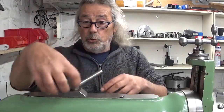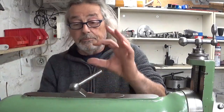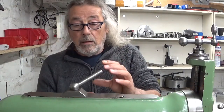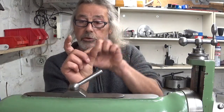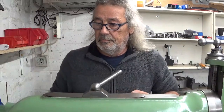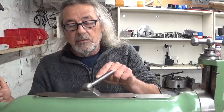Hidden under this screw thing here, there is of course the rocker arm. And because of the difference in length with the circular movement of the thing, there is a sliding system. And in there is, I think, a nylon block. And over time the nylon is getting a little bit bigger and bigger, which means it gets stuck in the U-shape thing. You hear the ticking sound.